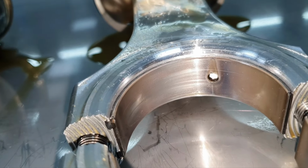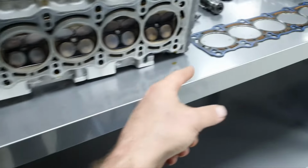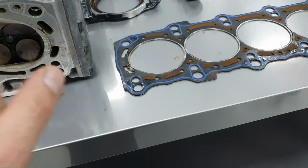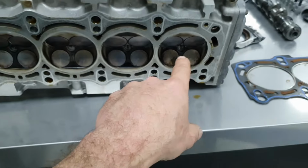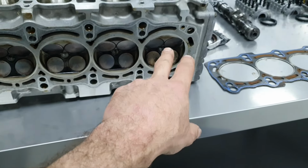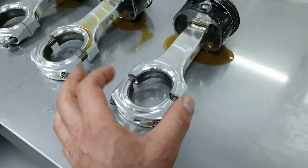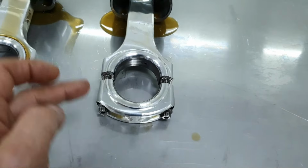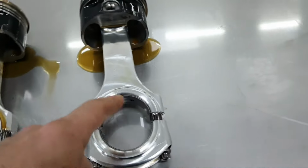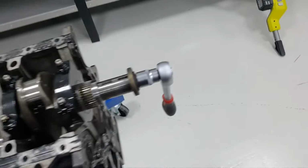Five, and six. Six a little bit less, most probably because what happened to the head gasket happened the first time. That's what I believe. And it was not making, that's why the temperature was lower by 100 degrees on the number 6 cylinder. I believe this has to do with the connecting rod. It's not pre-ignition or detonation. I believe it's the material of the connecting rod changing shape with the temperatures and pressures. But that's what I believe, that's me, all right?